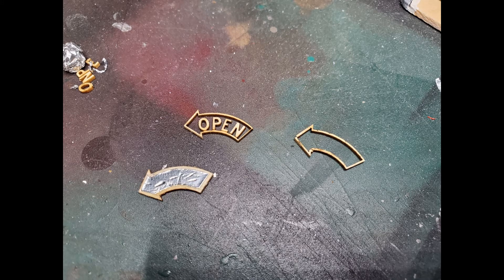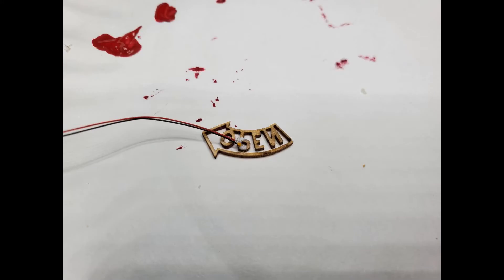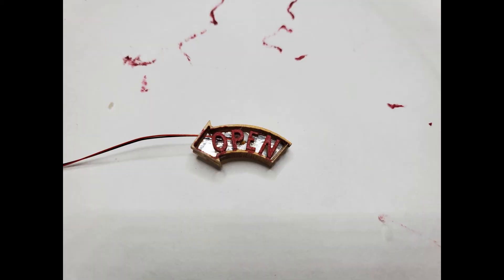I decided to remove the letters from one of the open sign pieces — you can see the letters in the upper left hand corner. I used that piece without the letters as a spacer and glued a micro LED to the inside of the remaining open sign. With the three pieces assembled, the micro LED faces the foil so it's shining towards the reflector. I tested the sign and may experiment with resistor values to adjust the light intensity, but probably won't do that until the structure is permanently mounted.